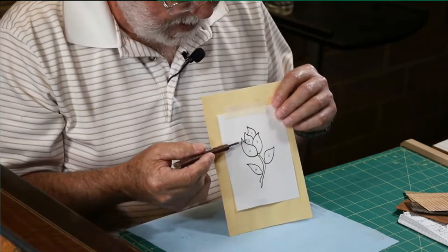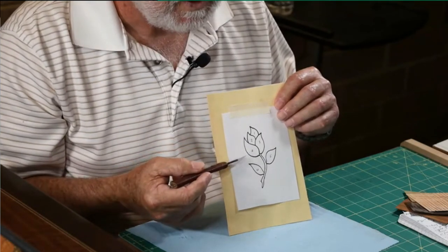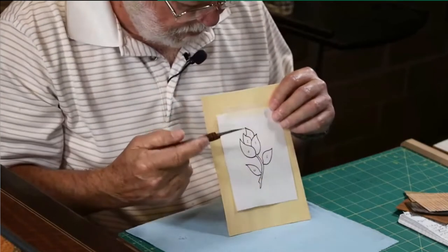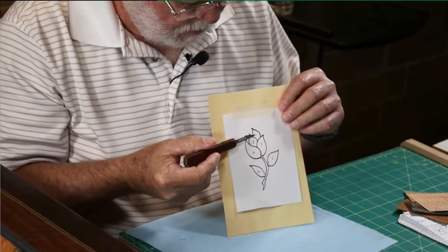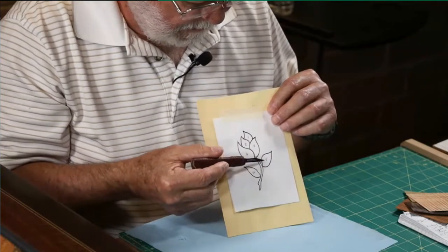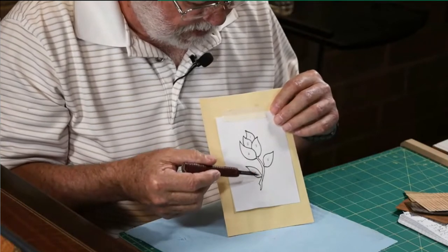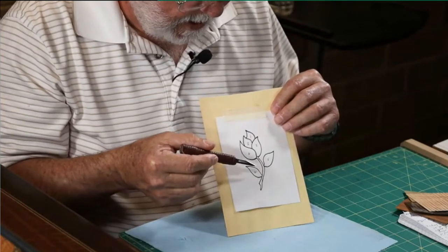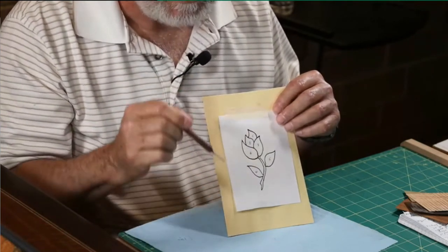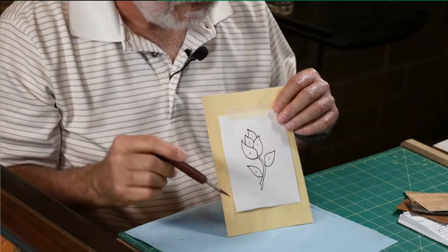And it would be followed by this piece, which is behind the next 2 pieces that you're going to cut. So you've got to cut the furthest and progress from that toward the front. So the order of cut is 1, 2, 3, 4, and 5 and 6 are interchangeable. You could do one before the other. The important thing is you want to be able to cut the stem into those 2 pieces because they're going to overlap a little bit to give you that kerf line that disappears. And you'll see that as I cut.